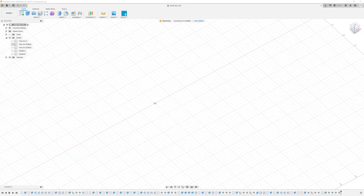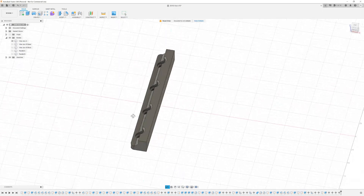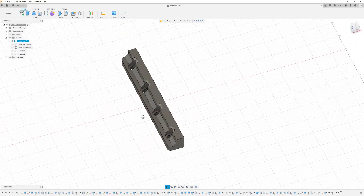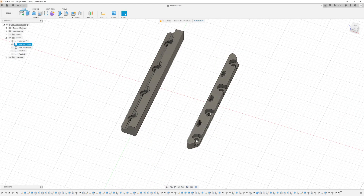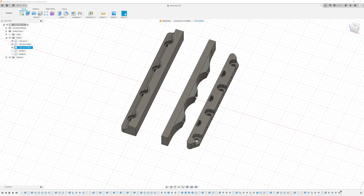The design turned out to be relatively simple. First of all, it's the left jaw — or rather the stationary jaw — that is attached firmly to the work bed with M5 screws and some 30x30 T-nuts to securely attach it into the aluminium work bed. Then it's the second block that you also attach to the work bed, mounted with M5 screws and 30x30 T-nuts, and slots for 20x20 T-nuts that you use to apply force on the soft jaw — and by soft, I really do mean soft — that is just pushing the workpiece into the left jaw.